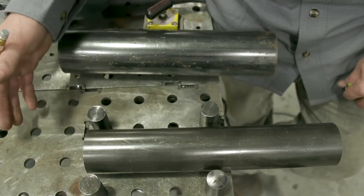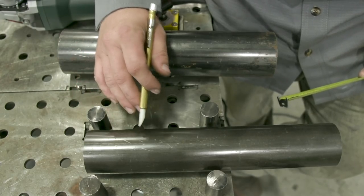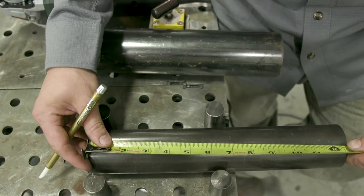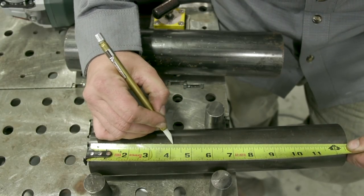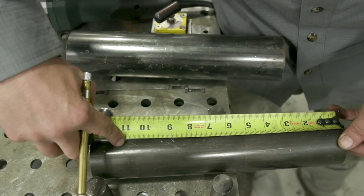Let's say we got a blueprint. We're looking at a blueprint and it says the pipe's got to stick inside the other pipe four and a sixteenth. So we're going to come here and just mark four and sixteenth here. Then the other part of the drawing says from here to here you've got to maintain eight and five-eighths.